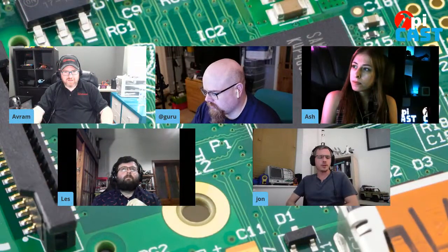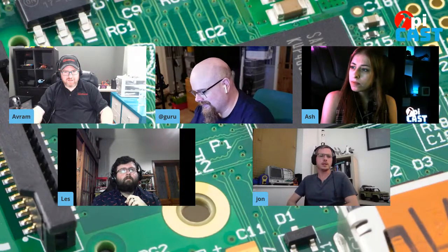The Unicorn Mini takes advantage of the PIOs on the RP2040. The RP2040 has a feature called PIO — you can write very small programs that run completely independent of the main ARM cores. Those programs can toggle GPIO pins, stream data in and out, and do basic manipulation. They're tiny, like 32 instructions long, written in assembly. For the Unicorn, it allows us to perform all screen updates completely independent of the CPU cores. There's literally no load on the Pico — it's just sitting there while the PIOs do the updates.